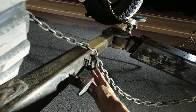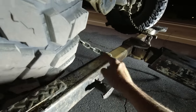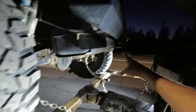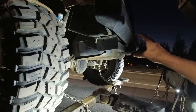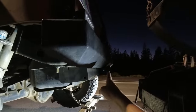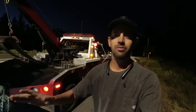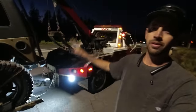I do have frame forks in this truck — I could fork that hitch receiver right at the back and tow it with the wheel lift picking up from the back of the vehicle, and I would have the exact same rear axle and front axle weight transfer as using that sling. The sling does not allow you to tow a heavier load with better weight transfer — stop saying that. The key is how much weight you pick up and how close you can get it to the back of the truck, picking it up from farther out the back, giving more leverage.